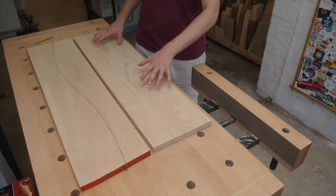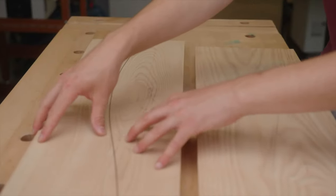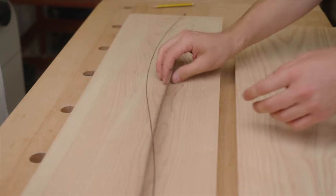Now I've got the line drawn I want to explain exactly what I'm doing. With this example I did earlier it's got a very similar curve — I cut that out with a jigsaw and then once that was cut out I had two halves with opposing curves. The next step is to glue the veneer in. I got a thin strip of walnut veneer — you can use any contrasting wood you like — and the reason that fits perfectly in there is because the thickness of the veneer is the exact same size as the kerf cut from the jigsaw. Once we've added glue to either side of the veneer we then clamp the boards back together and later on we'll sand it flat. I'm going to do exactly that process with this board right now.